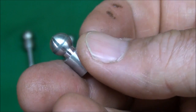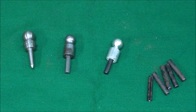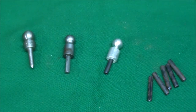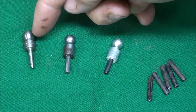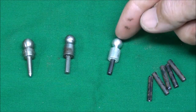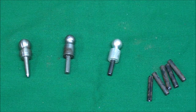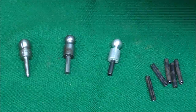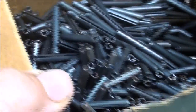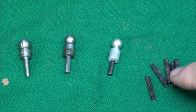I have already made the form tool, which is very similar to another video I did — Tips 118 — on making a form tool. That was made off camera and is not the same one used to make this, but it's very similar. This is a larger ball: this is 5/16ths rod and a 5/16ths ball; the other was 3/8ths, so there's a little difference and I couldn't use the same tool. These are roll pins — spring pins, tension pins, there are other names for them — and you can get those at any hardware store. I'm using 1/8 by 3/4 inch long.